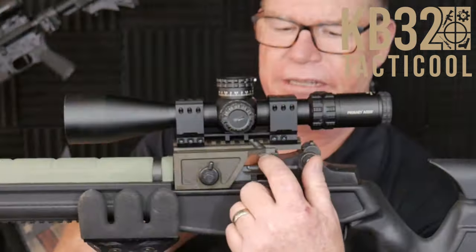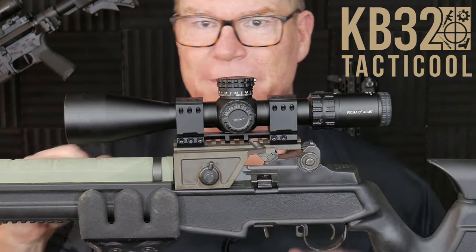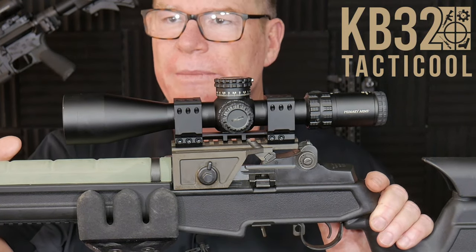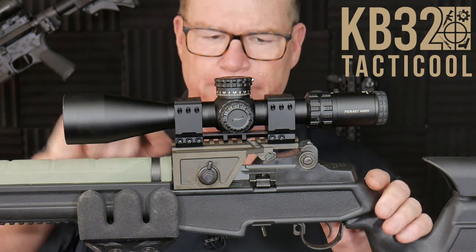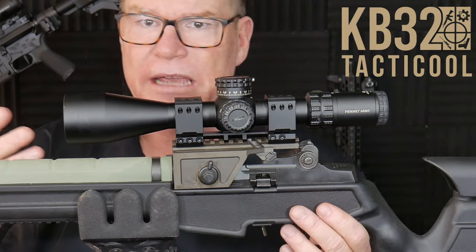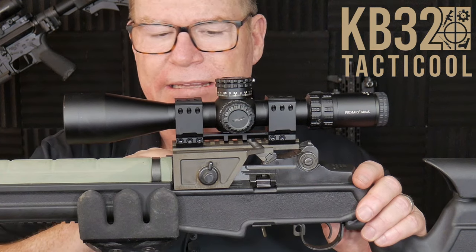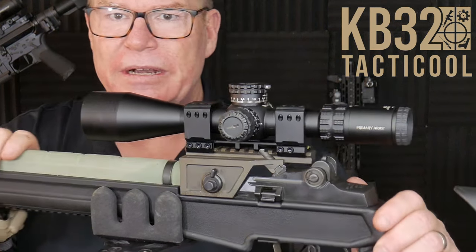There is a dovetail section that takes this part out right here — the clip piece that goes up and down. There are two screws that go into the back of this thing that feed into that dovetail section. A lot of the other mounts you'll see out there only have one set screw; this one has two — I like that. Loctite all of them in, mounted the scope, and man, isn't that cool?